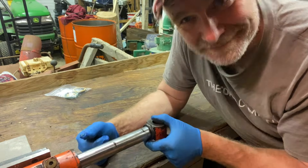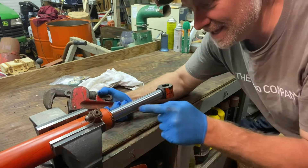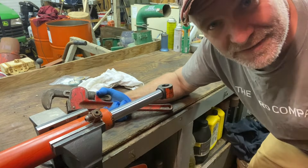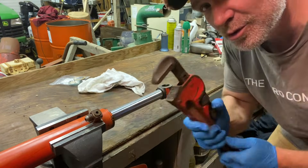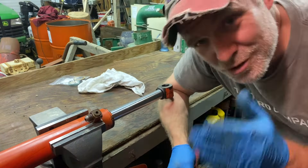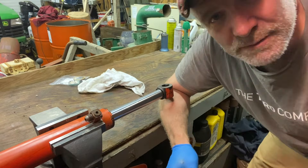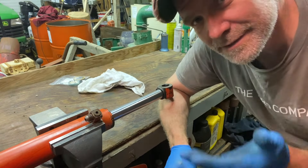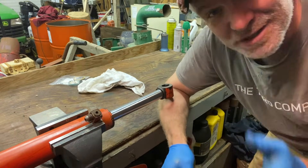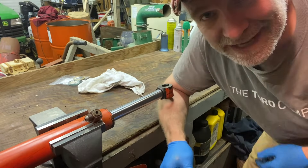The first thing you do is throw the cylinder in the vise. There are special tools to remove these caps but most people don't have them at home — most people do have a pipe wrench. Pipe wrenches do make little marks on the cap, but most people don't have the proper tools to take the cap off without marking it. You can still make a really good repair; there's just going to be very slight marking on the end of the cap.